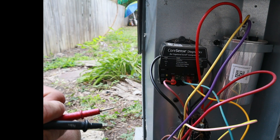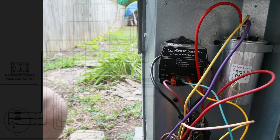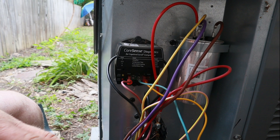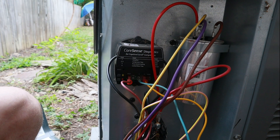So we've got power going to a lot of places even though the contactor is not pulled in. We also see a purple wire connected to the common terminal on our dual capacitor — tracing that out on the schematic, it goes to the main winding on our condenser fan motor, through its internal overload, and comes back on a black wire all the way to T1 again. This shows that with a single pole contactor you're going to find power pretty much everywhere; with a double pole contactor, we wouldn't be getting all these readings.